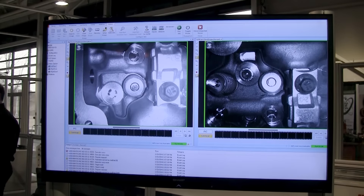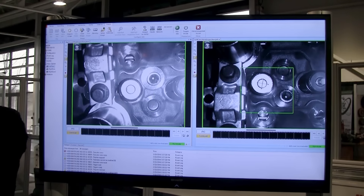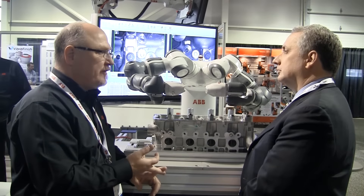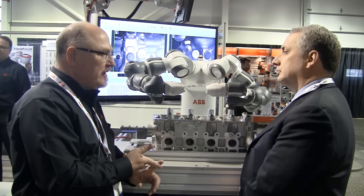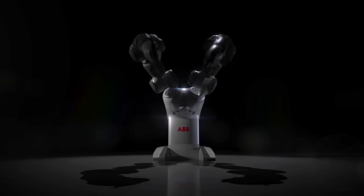With this particular application, we're looking at 152 different separate points. We're looking for missing bolts, making sure that the holes have been drilled, and we're even looking for casting marks or locating marks as well. We can do all that hole inspection in one go.